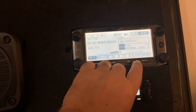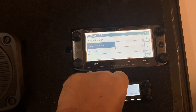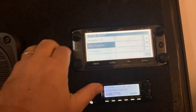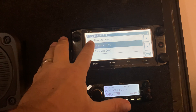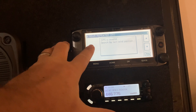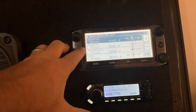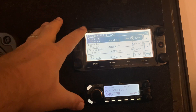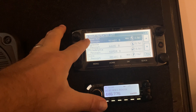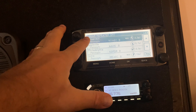It also has a little icon showing it's sending my GPS location as well. So if I'm in digital mode, I can touch my channel and then go into a list or look for a nearby repeater. I'll go to nearby and select digital. It's telling me it's going to search by my last GPS position since I don't have a fix right now. Here are all the repeaters — here's Delstar East, N3AEC, 6.8 miles to my southeast.